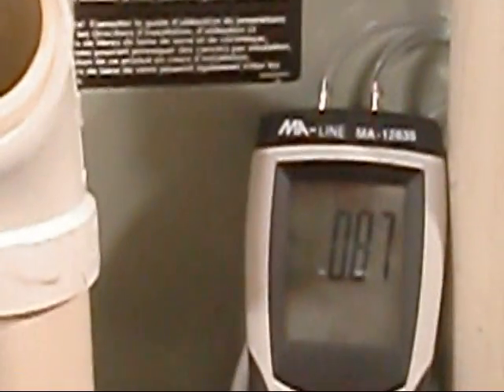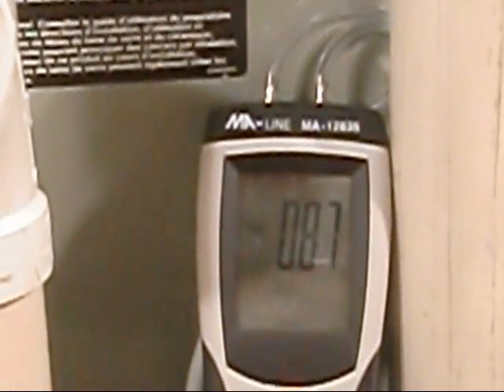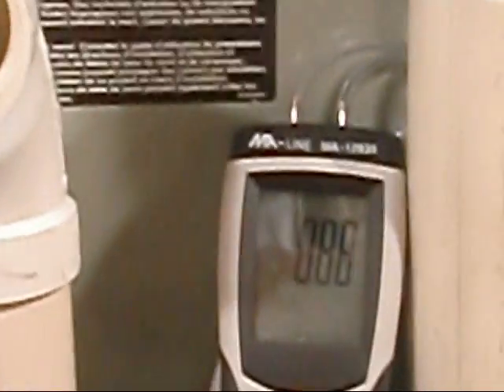I'm going to call it 0.88 — it's between 0.87 and 0.89, so I'm calling it 0.89. That's the black wire on high. Let's check the furnace — model UX1B080. At 0.87 to 0.89, we'll call it 0.9 static pressure. At that reading, we're at 1,147 CFM. We're close to our target of 1,000 CFM but a little high.